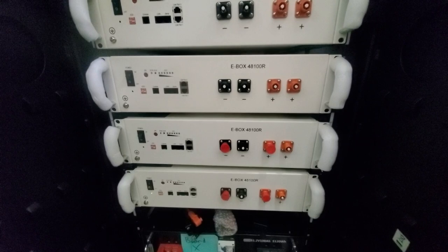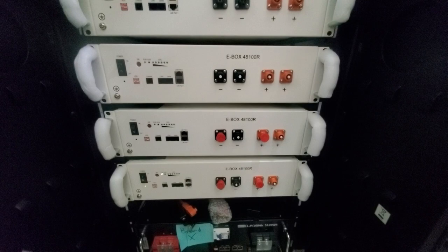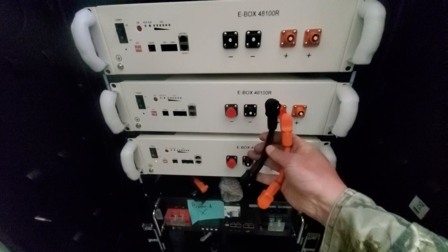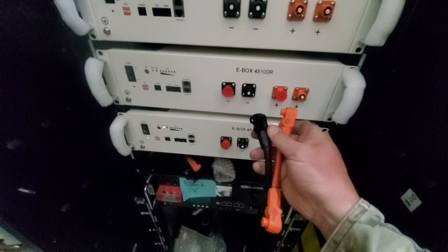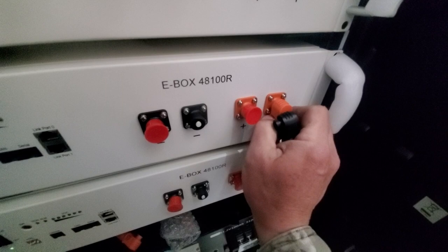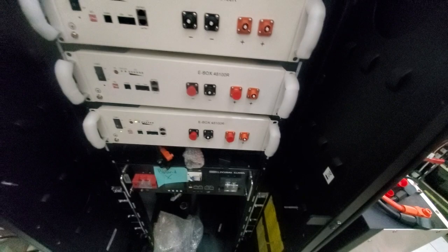What comes with these batteries are two different connectors. This is to link multiple batteries together — it's click, click, pretty simple. There's a push button on the side; you put the cable in like that, then use your thumb on the push button to pull the cable off. It also comes with one of these cables to link future inverters to each other, and a little ground wire to link all the batteries together.